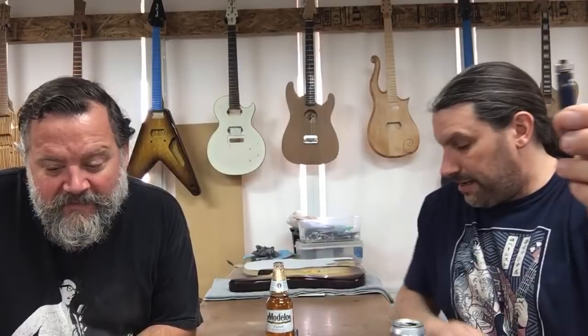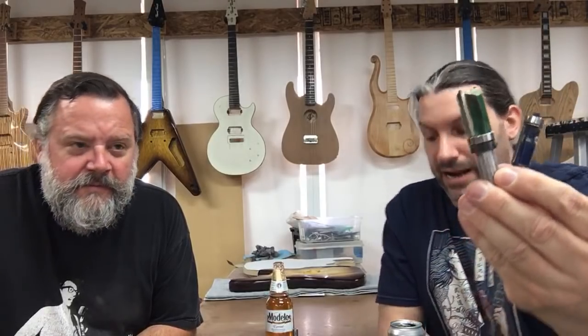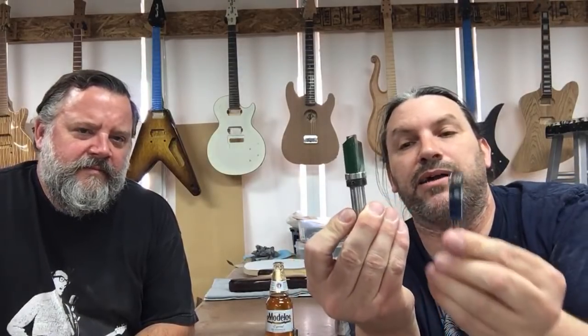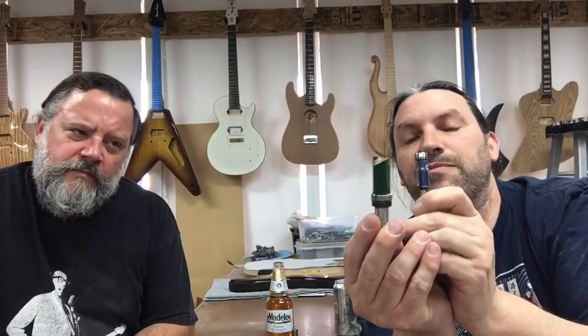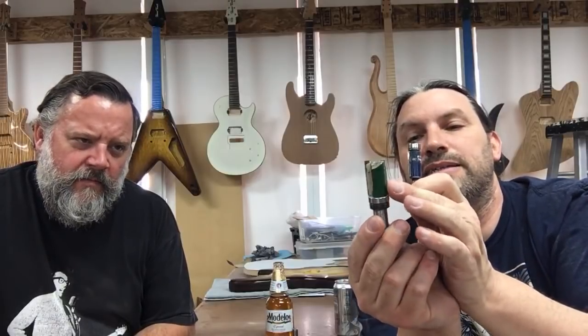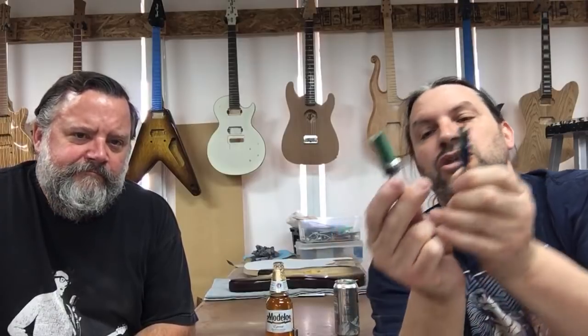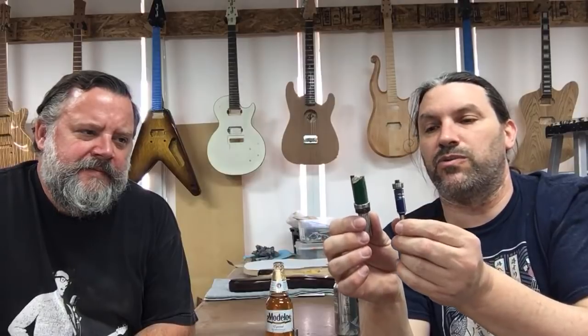They make the opposite of this — here's a bigger version. This one has the bearing on the bottom and the cutter on the top, or the bearing on the top and the cutter on the bottom, depending on how you orient it. It's the same kind of deal: a bearing that rides on a template and a blade that cuts the piece. These are two styles of bits you should absolutely have if you're going to work with templates.